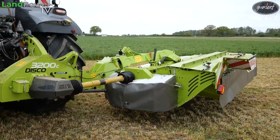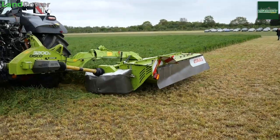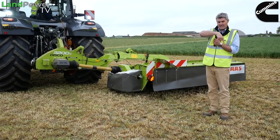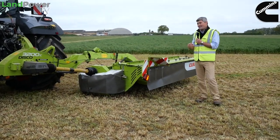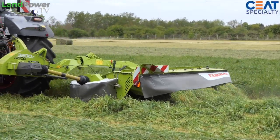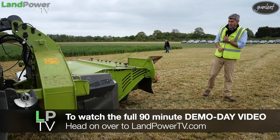When we go to a wider one - for example our flagship Disco 4400 which is 4 metres wide - instead of bolting another module on, we just use longer base plates: single pieces of steel pressed to form the shape, then bolted together to make them a lot stronger. On the mower bed itself, we mount the mowing discs right to the very front of the mower bed. As the disc rotates, we're trying to get a full 180-degree rotation of the blade actually mowing. Where mowers have the disc in the centre of the bed, you're only cutting for maybe 140 or 150 degrees, and that reduction affects the overlap of the blade between each individual mowing disc. With plenty of blade overlap you get a nice clean stubble; where you lose the overlap - especially when grass has gone flat or tangly - you start to see a scruffier stubble left behind.